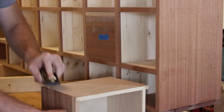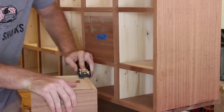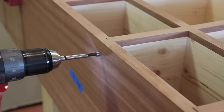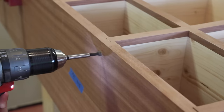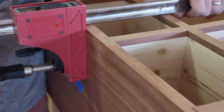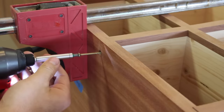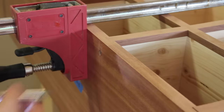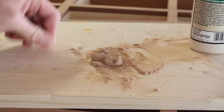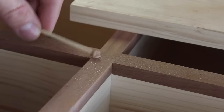Fitting all 21 of these drawers actually took a fair amount of time. I used the block plane to trim up the ends of the drawer fronts, which I left slightly proud, and then trimmed the tops and bottoms until I got a nice solid fit. As a result of some of the mistakes I made with the dados and out-of-square dividers, a few of these short dividers unseated themselves by about a sixteenth of an inch. The best thing I could come up with was to clamp the gap shut and drive some screws in. I know throwing screws into end grain is not ideal, but it was the best I could do. I covered them up with some walnut plugs so now it looks a little more decorative. I also made some homemade wood filler with glue and Sapele sawdust to fill in any other gaps.